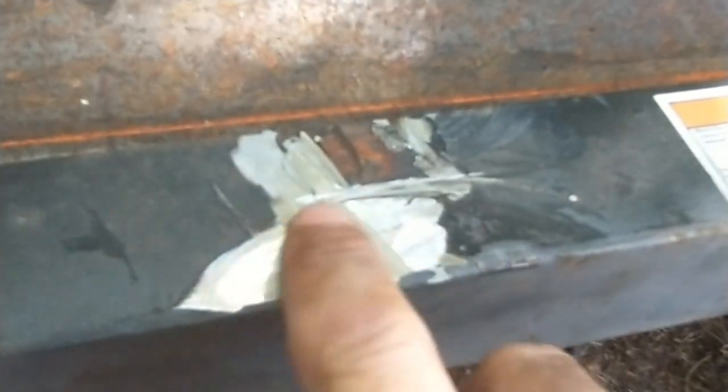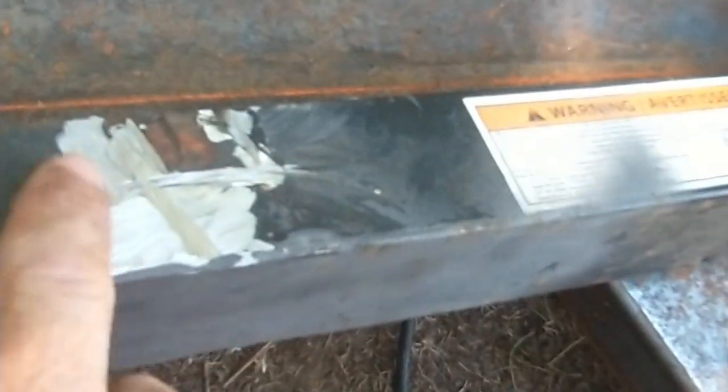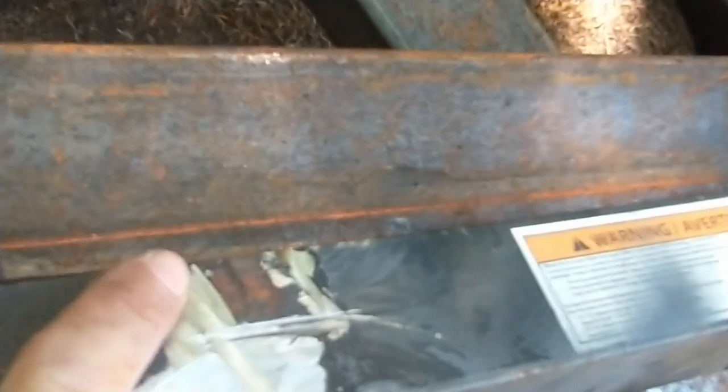See, I'm actually proud of the surface with all of it. Same with this one over here. See? Now this one I did get down into the frame a little bit. I got a little line where I was trying to cut from the bottom. But up here, maybe a little. Right there. And here's where he welded it originally. And this crater crack, can you see the crater crack in it? Camera won't really focus. There's a line in there. Oh yeah, you can see the line.